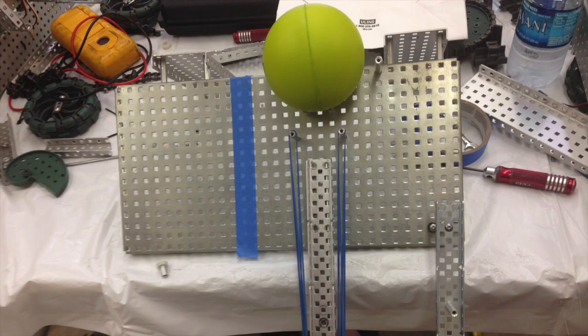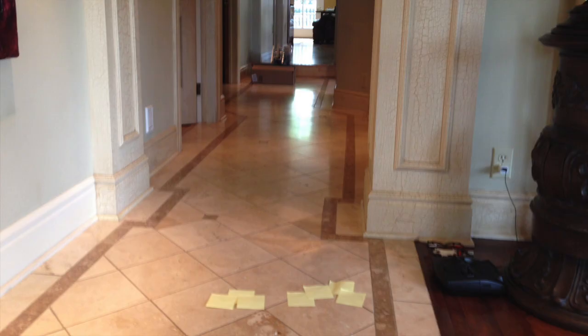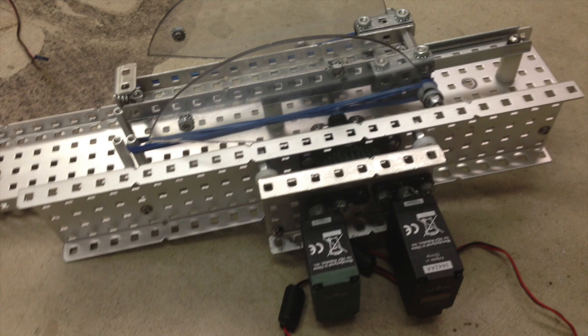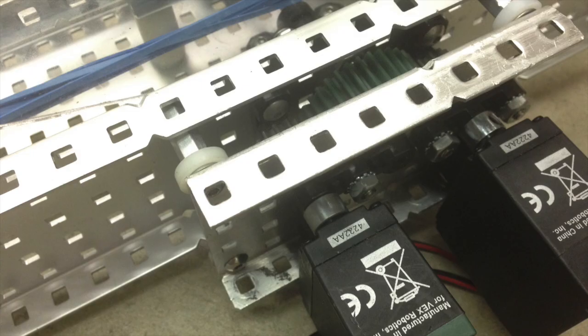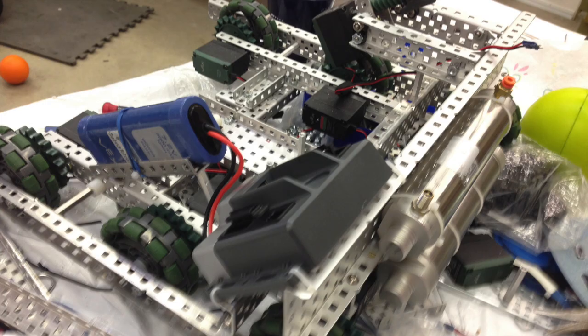We built and tested the piston design. This scatter plot is for seven of the same balls, and this one is for seven different balls — by far the most accurate design, so we're going with this. We used a custom plexiglass nautilus gear to pull the piston back, cut out using a template that can be found in the forum post linked in the description. After experimenting with many gear ratios, we settled on a two high-speed motor, three-to-one gear ratio to power the nautilus cam.